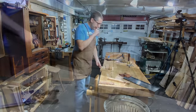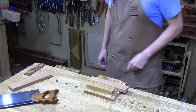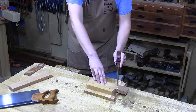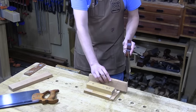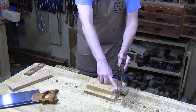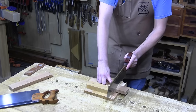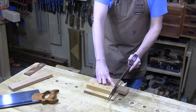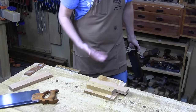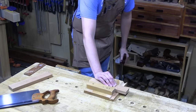Illustrating the principles of sawing — number one, you can see the line, you can saw the line. What I've got here is I have to saw a shoulder that's at an angle to the face and at an angle down the edge. So I'm sawing a compound angle. If I'm normally sawing a 90-degree shoulder that runs perfectly plumb, now I'm sawing off the plumb angle and off the face angle.